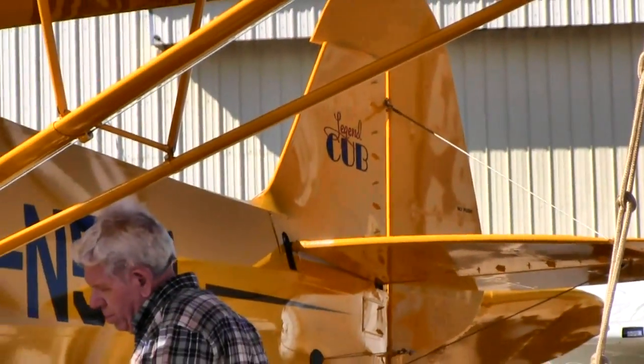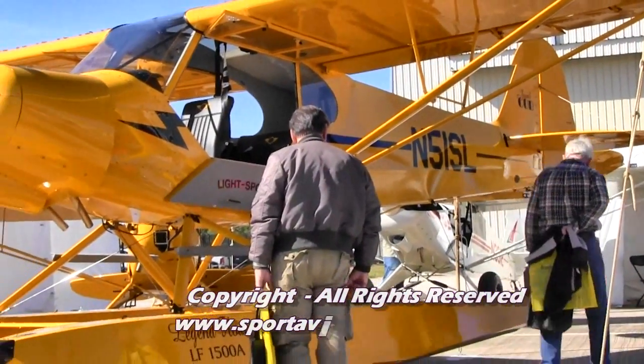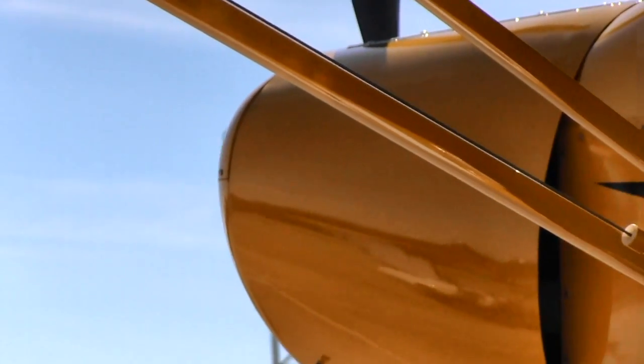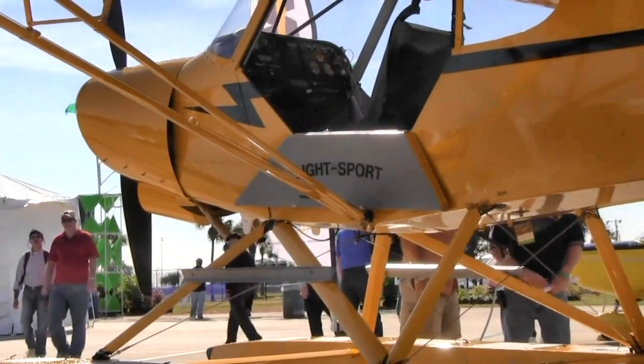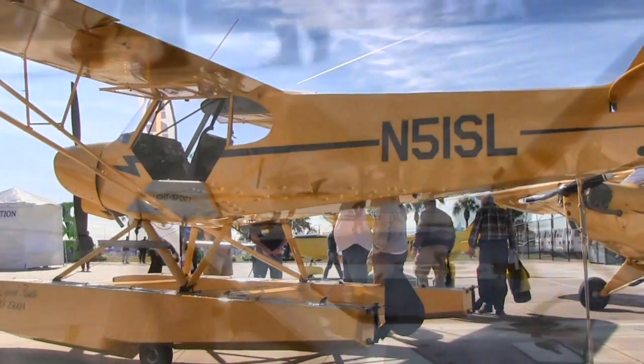This airplane has a basic instrument panel and a lightweight paint package — even paint adds up, so we have to trim that down. You have to look everywhere you can possibly save weight. We do a lot of lightening holes in secondary structures. For example, this step here is a carbon fiber step. Even small details matter — and then you look at things like washers: a handful of steel washers can be five pounds, but switching to aluminum washers cuts that roughly in half.